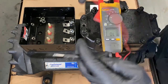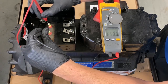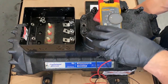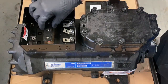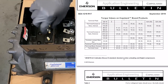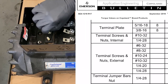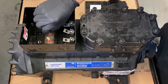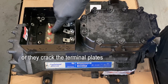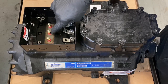If you have bad windings, check them right from here. I still have bad windings, as you can see. So I've got an electrical issue for sure. One thing to point out: if you're putting these on, there are proper torque values. See how this moves up and down? That is connected to the winding. If you just tighten these screws as hard as you can, what we've seen is it damages the connection to the windings — after 6 months, a year, 2 years — because guys didn't use the proper torque values, which led to compressor failure.